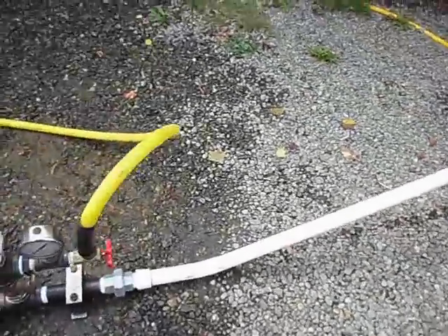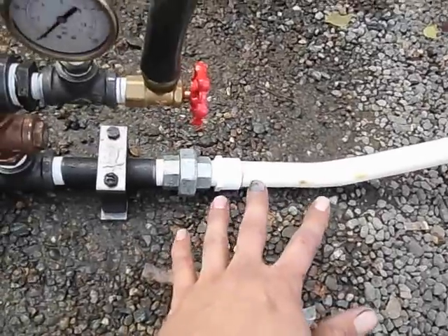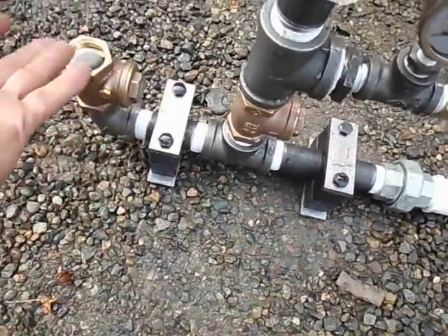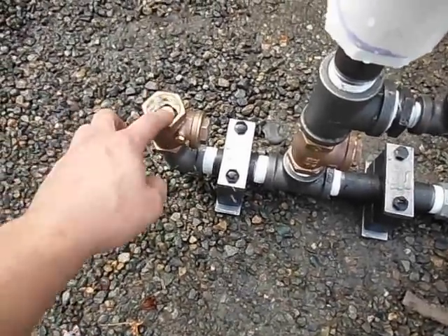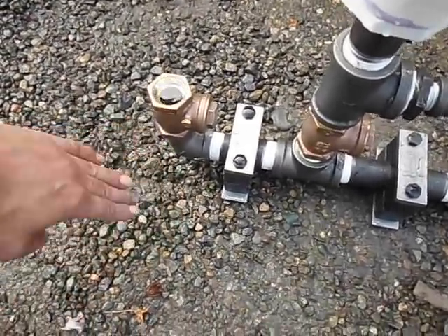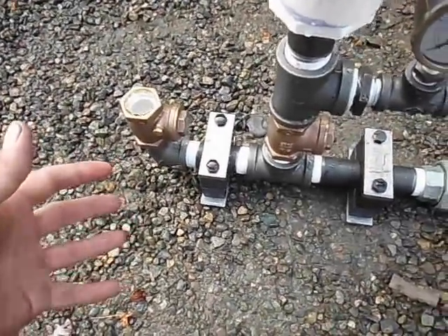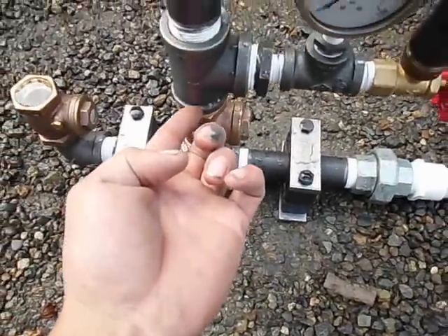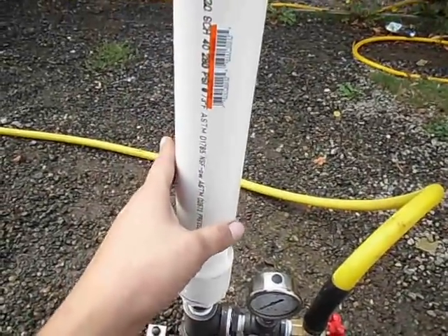I have a garden hose that I just pour water into it, so the water comes flowing down this one-inch pipe. Because it has some weight and gravity behind it, it has some force. It continues through this pipe and flows out this valve until the flow rate reaches a point where the little flapper can no longer hold it back and it slams shut — that creates what's known as a water hammer effect. The water then has nowhere to go but up through this check valve.